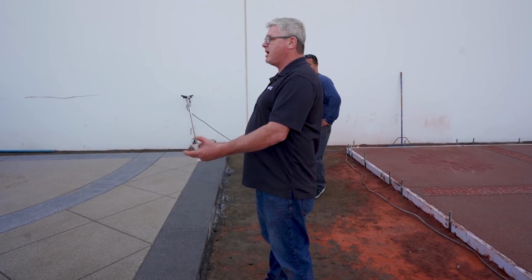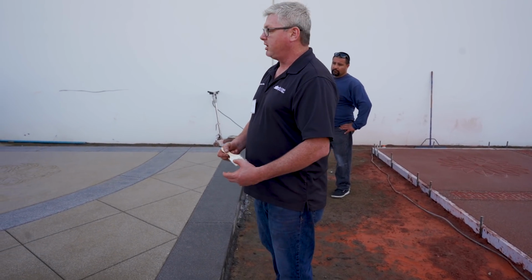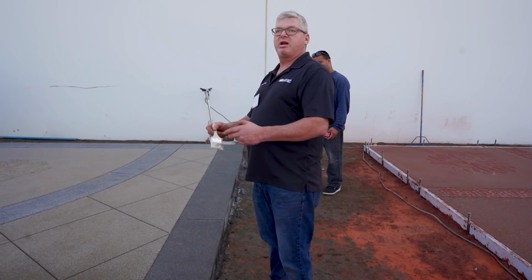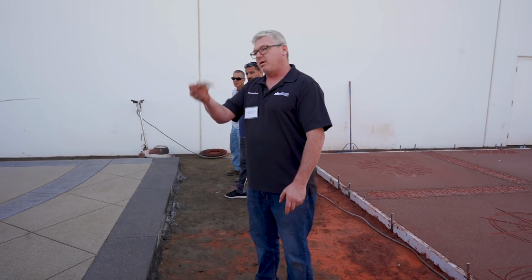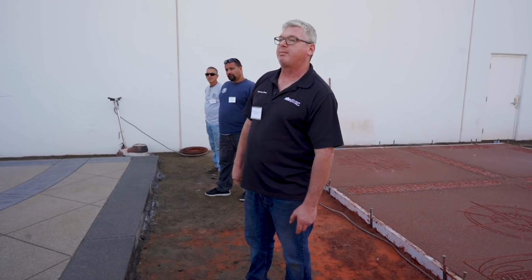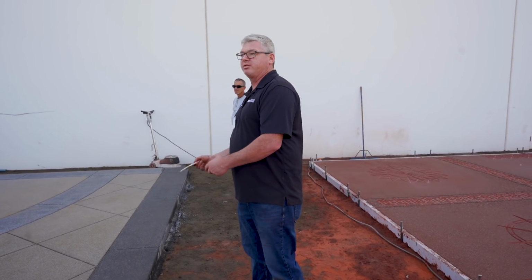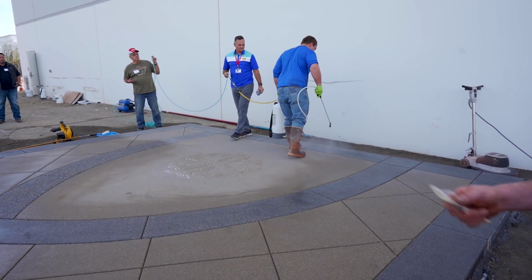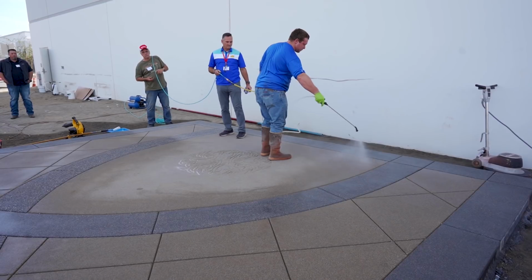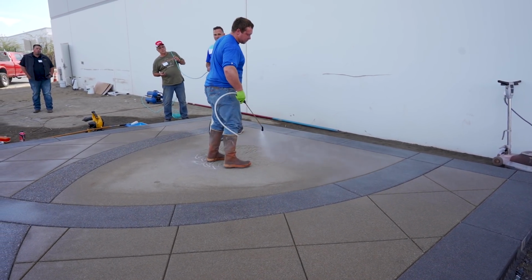And so you spend all that time with your exposures trying to get it consistent, you wanna keep your sealers consistent. You send out your laborers, they don't really have much direction, so you wanna hone them in and explain why, because you can come back the next day, and matter of fact, it was Ross, he says, I could see and I could tell what my guys did. That's because they're over applying the material in certain areas and not others. So whatever you're doing, you wanna keep it consistent. The guys are getting lazy and they're not pumping. You're loading up material because you're trying to cover a smaller area. That fine mist right there is staying consistent.